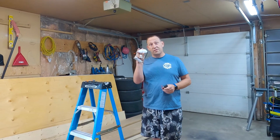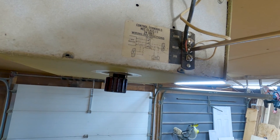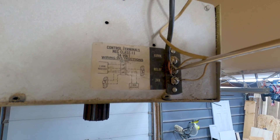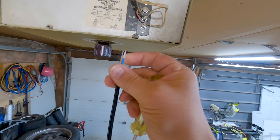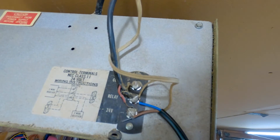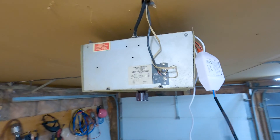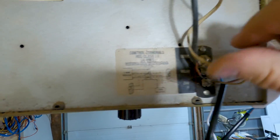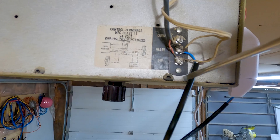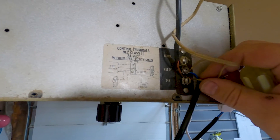I'm going to focus on the actual box first and then look at routing the cable for this to the door. What we need to do is loosen these contact screws — and don't short that out with your screwdriver while the garage door is powered. We just need to loosen these contact screws and then attach the wires from the box. It doesn't matter which wire goes where.